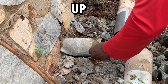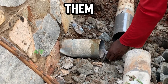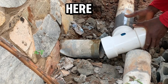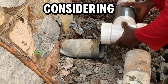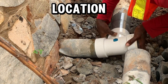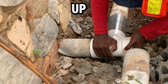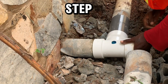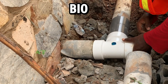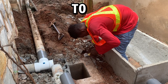The key here is when you show up on site, you should know where all the pipes are meeting and where to terminate them. If you have a fair idea of where to terminate them, you can position the biodigester accordingly — also considering the type of soil and the location you are choosing for the biodigester construction. There is a linked video with the step-by-step guide you need to know if you are going to construct a biodigester.